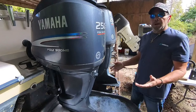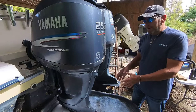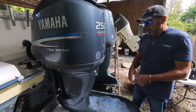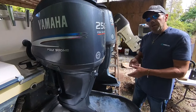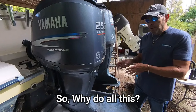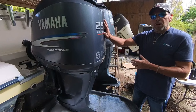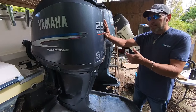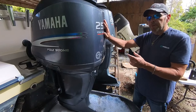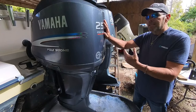100 gallons will last you — you can run the motor 10 or 15 minutes pretty easy before the water gets too hot. A gallon of white vinegar has already been dumped in here. There's just some residual soap in this. What I'm going to show you is how we inject the soap into the intake screen of the motor once we crank her up. The importance of this is that it'll clean out your water passages, your thermostats, and it'll clean up your anodes. The vinegar does that part.